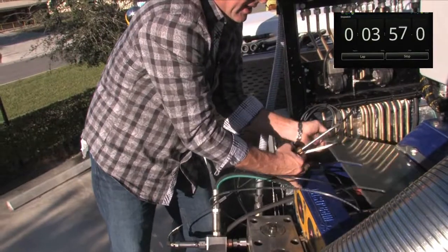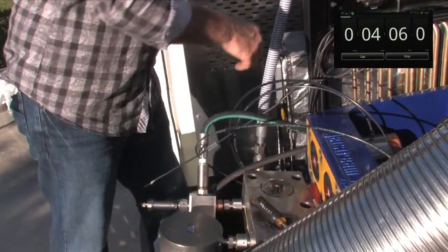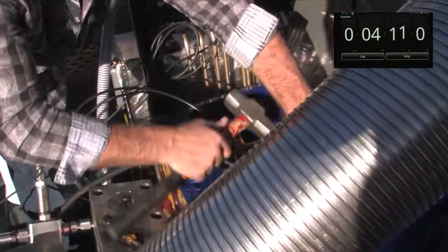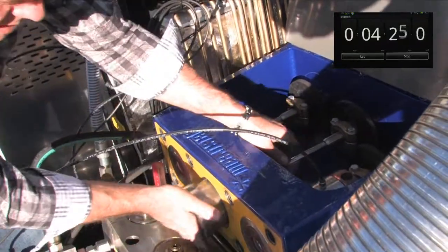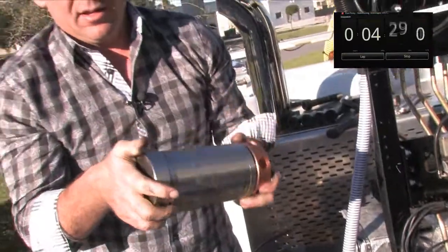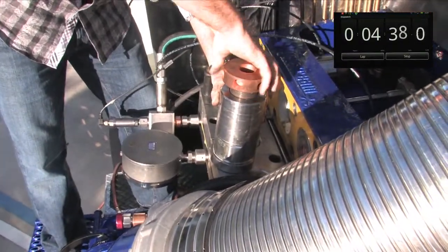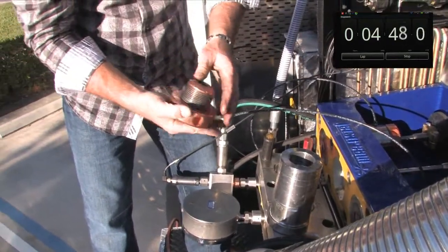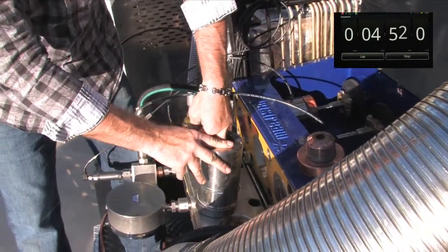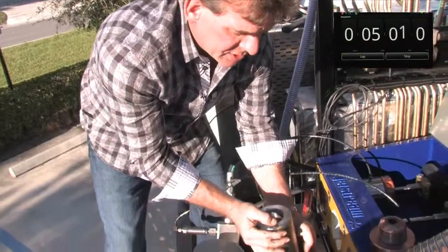Now I want to show you a really useful feature of this pump. Using this tool, you can loosen the packing nut. This is simply a line to keep the plungers cool, which is done with water. You can see that the entire stuffing box comes right out. To access your packings, you can do so right here. Here's your carbide backup ring, and your packing can be found just on the other side of that. I would need a screwdriver to get that out, but I don't want to do that just now as the packing is in good condition and doesn't need to be replaced.